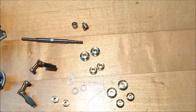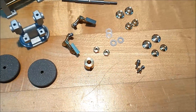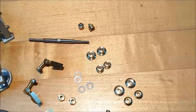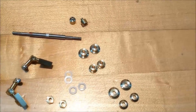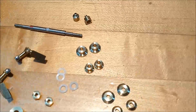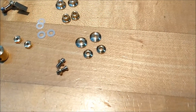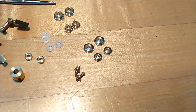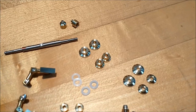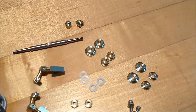Now in doing that, the hubs, in order to maintain some degree of scale with the larger nut, needed to be increased as well. So you can see the new hubs are the bigger ones, center screen right now, and these are the original size ones right below it. Same thing with the outer flange — the outer flange is a little bit bigger than the original. So if you go with the 172 on the print, this is the size you can expect. That's quarter inch major diameter on these, and that is 5 sixteenths — that is only about 1.2 millimeters larger, but it looks like it's a mile.